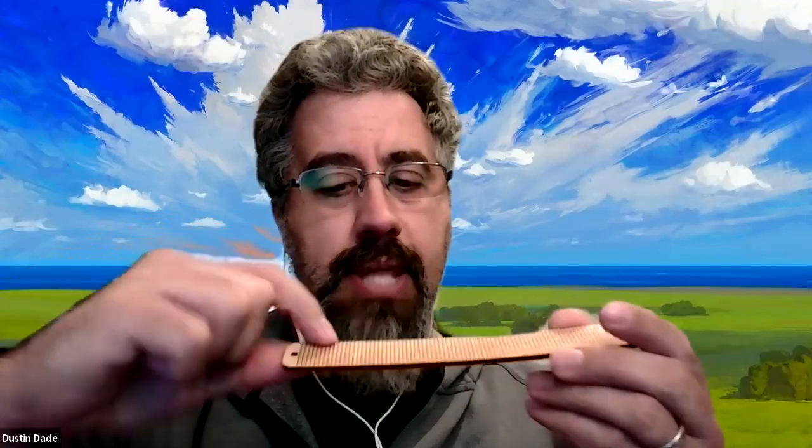Anyway, I was thinking about taking this stuff, flipping it over and cutting grooves out with the CNC, so that you have the width of the bit and cut it down to that last layer, and then that should allow it to warp and shape. I've seen Tim Sway do what he called wacky wood, same principle. He takes a V bit and goes back and forth, and that creates a V-shaped channel to close down whenever you need it.